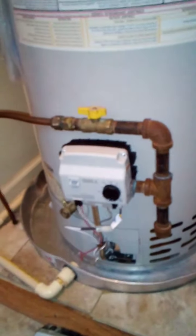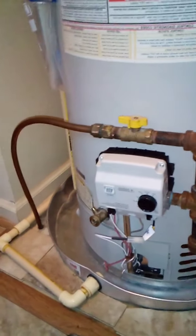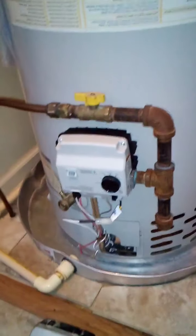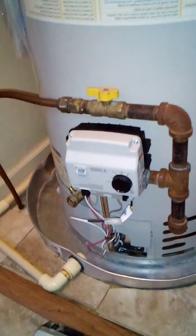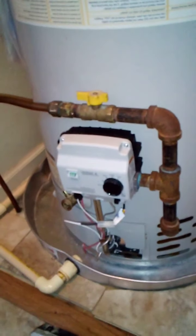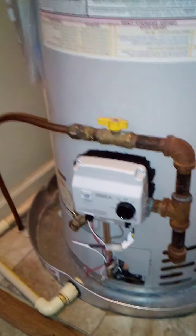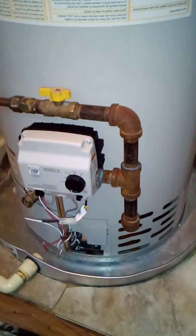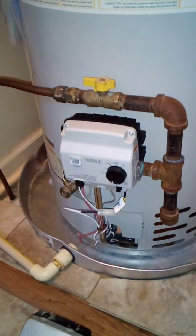That is really what's wrong with this Honeywell unit. If you have a Honeywell unit like this one, there's a possibility that could happen. If it does, this repair is actually a do-it-yourself job — if that copper gas supply line feeds directly into the inlet valve of the temperature control valve. If it's like my setup with steel elbows and steel pipes all connected, you may want to get a plumber out there.